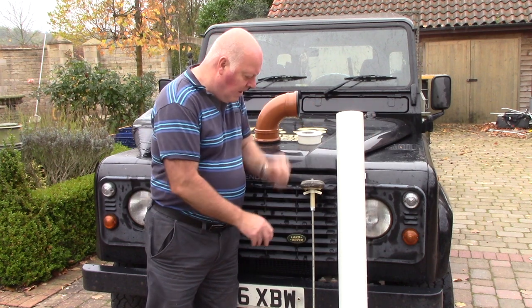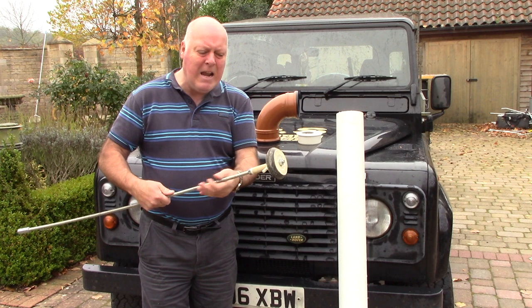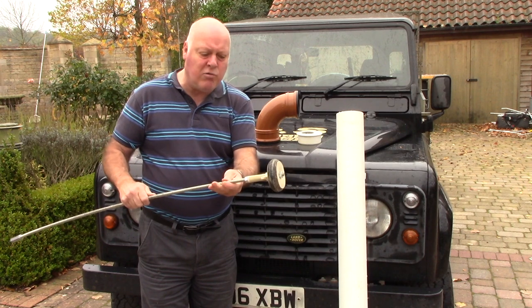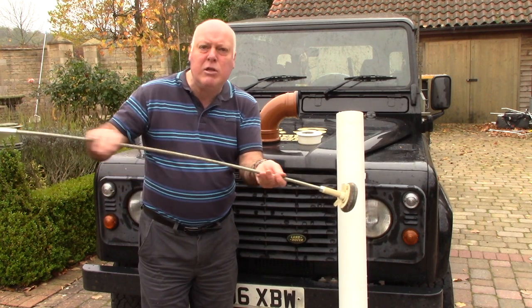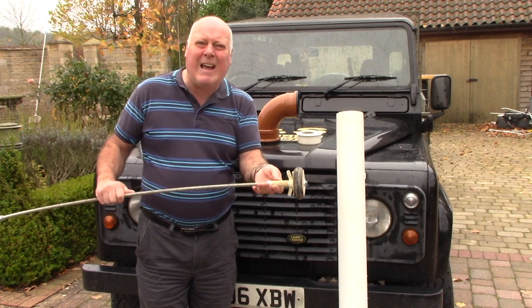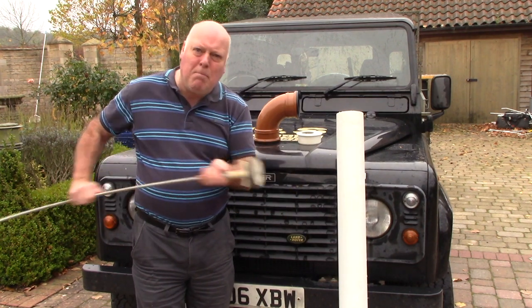This is a drain bung — they use these for the drains. I like this one because it's adjustable; you can tighten up the rubbers to make it a good fit within the drains. These may cost six or seven pounds. This is threaded bar which I've used as a plunger. If you can't get threaded bar, use a cane, use a bit of dowel — whatever you've got, as long as you can plunge it.